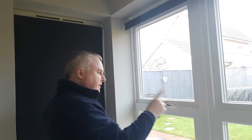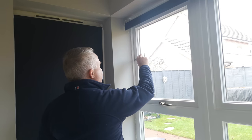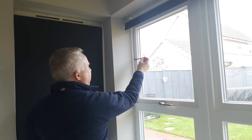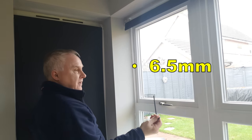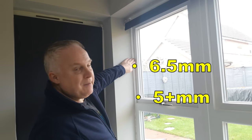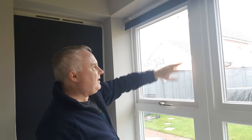You need to make sure you buy the correct type and size of seal. Measure the gap around your window in several places. Use hex keys or drill bits and try to fit them into the space between the closed window and the frame where the seal fits. This is a six millimetre hex bit and I can fit it into the gap, which means the gap is marginally larger than six. I can't get a seven in there, so I'll call it six and a half. Across the bottom the gap is below six — about five millimetres. A seal with a six millimetre bubble would still leave a half millimetre gap, so buy a seal with a reach of about two millimetres more than the biggest gap you've got to fill.